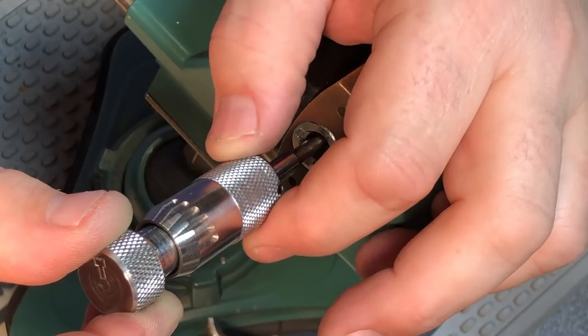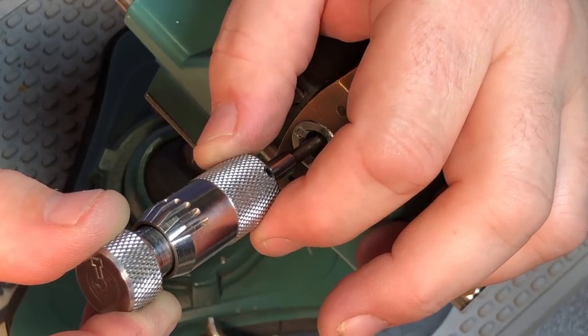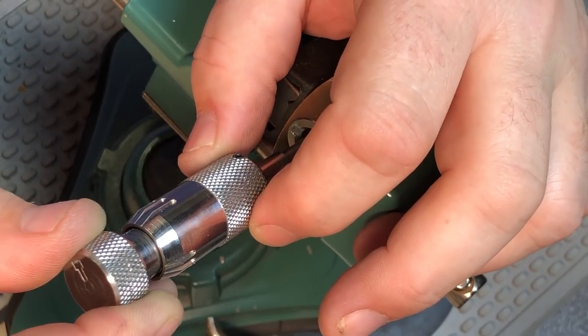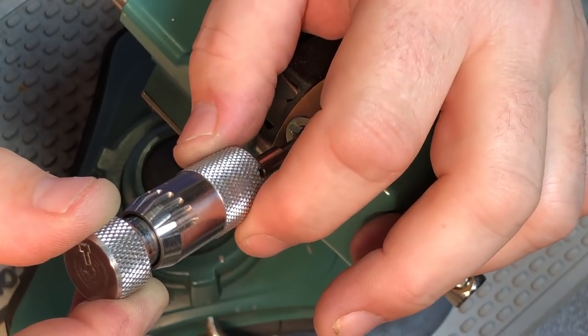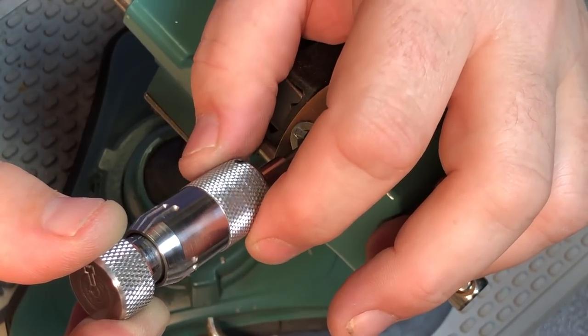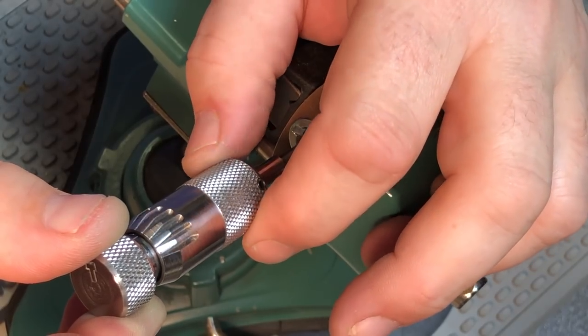What's going on with the lock right now is I'm continuing to drop into different false gates and work my way up and down the stack, testing the other discs to see if they respond differently. If a disc is in a false gate, it may have jiggled freely a while ago, but as I move other discs into true gates it would become grindy or stiffly bound.